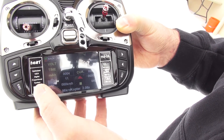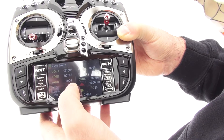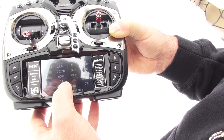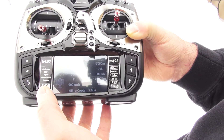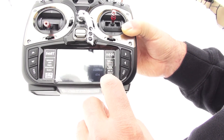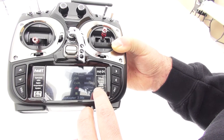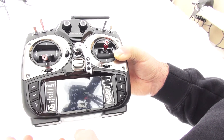Time shows how much time it's actually been flying for — that'll start counting when you start the motors. Milliamps shows your amp draw. And this one says 11 — that's how many GPS satellites. For this to actually start the motors, you need at least six satellites. You also have altitude, what direction it's pointed, current draw, and I believe this is how many meters away from our home position, which is where we start the motors.